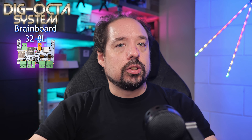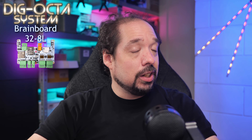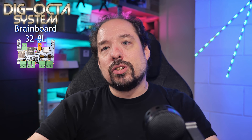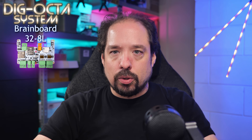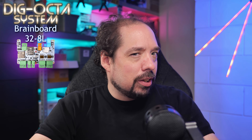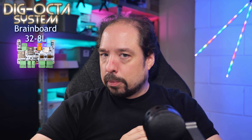An important subject is LED driving capabilities. The ESP32 and this board are capable of driving eight output channels at the same time, but not with the maximum number of LEDs per channel simultaneously. Running WLED software, it's advised to stay between 1500 to 2000 LEDs in total per brain board, with a maximum of 600 LEDs per channel.